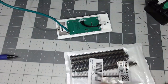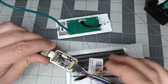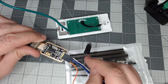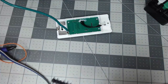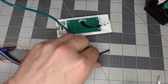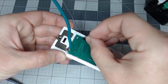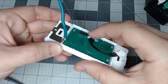To flash this, we're using a simple FTDI flasher set to the 3.3-volt position — make sure you don't use 5 volts. I'm using a little header pin connected together that allows me to split the ground to GPIO0. You can also just cut the wires and twist the ground and GPIO0 wire together as one. We'll cut off five header pins and place them inside the five holes, then connect our DuPont jumpers from the flasher without any soldering by holding a little pressure on them.